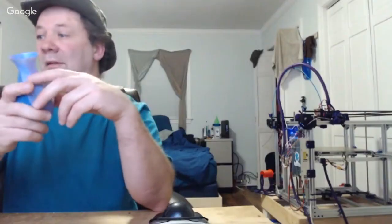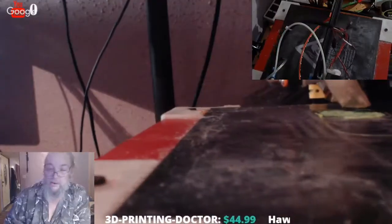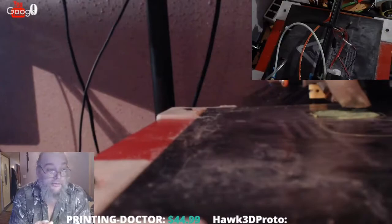Yeah. Like I say, this here got printed with a 0.6 nozzle, and the layer lines look nice on it. Yeah, no, I know. I was gonna say that actually looks better at 0.2 heights than the 0.4 does. My 0.4, oh, really? Yeah, it's rough at a 0.2 height. But I'm slicing at 0.4. My layer height's at 0.4.